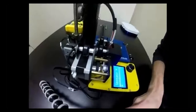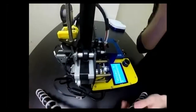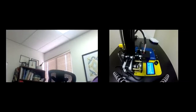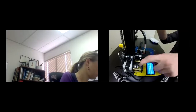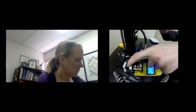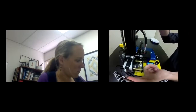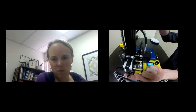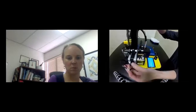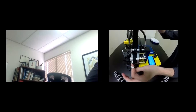There's a white input where the wire runs from the limit switch all the way to the control board. Further back is the motor — you want to make sure the motors are plugged in by the white input, and it should say 'X' on the tag. These motors are easy to unplug without much effort, so that's something that can happen — that's why we cover this step.